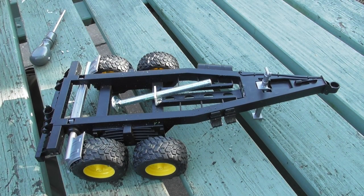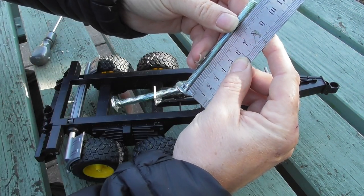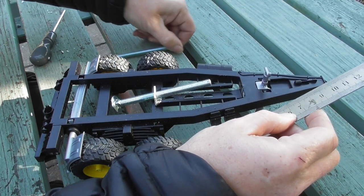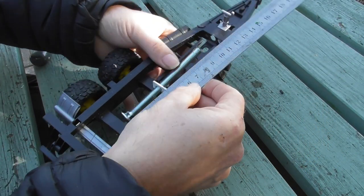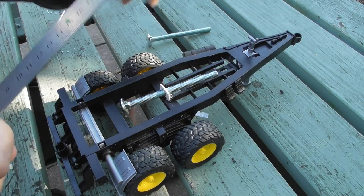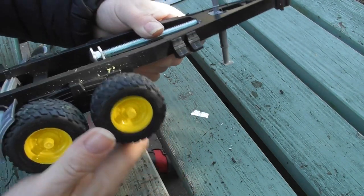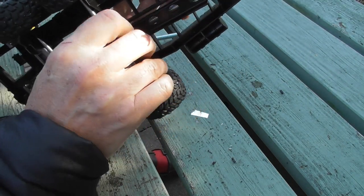So I only added a small amount to it. The original coach bolt was about 10 centimeters, 100 millimeters in length, and the one which I've replaced it with, in terms of an equivalent distance, is showing 105 millimeters. That extra 5mm is critical, because when it's put in, you can see how it actually comes into here a decent distance.